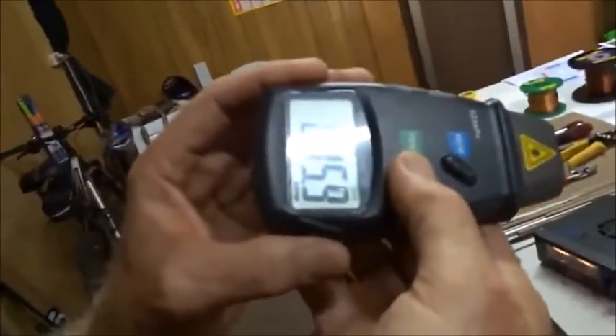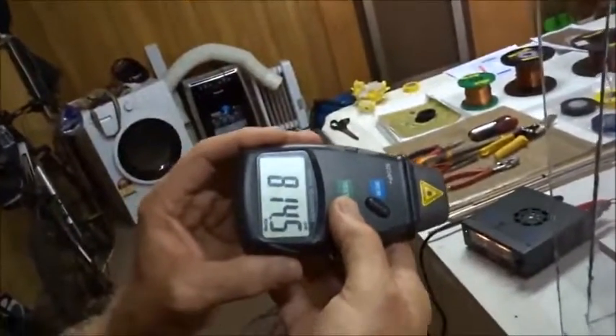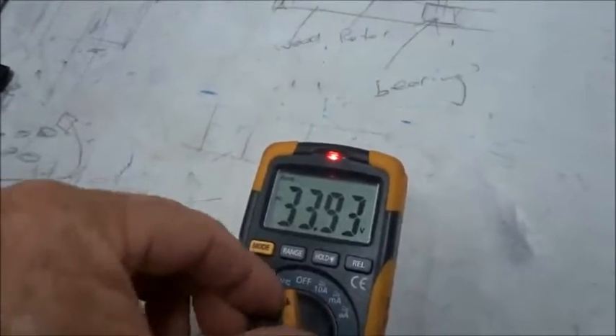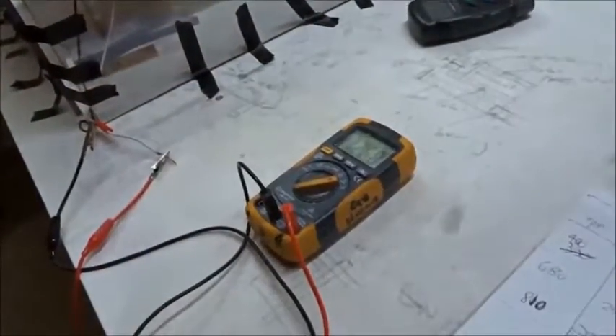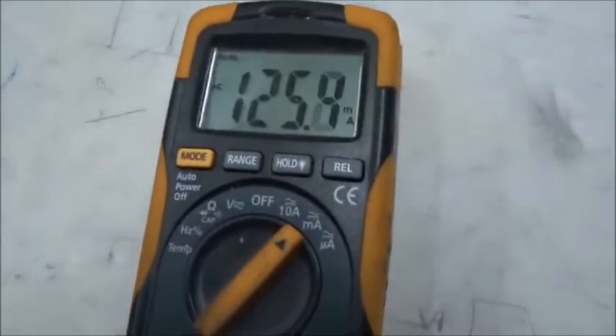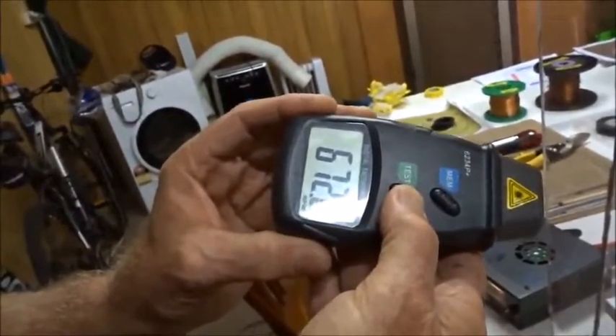Now with the tachometer we're at 810 RPM. We have two 60×20 millimeter magnets, which are twice as powerful as before. Keep your safety shielding up — at this high speed we're getting 33.9 volts and it starts off at 130 milliamps. When collecting current it only goes down to about 125, which isn't bad. When we short the thing completely, it goes down to about 670 RPM. So it's not too bad — a very good device.